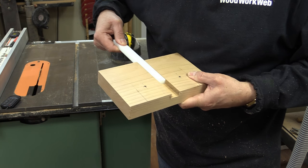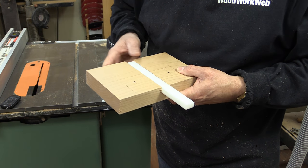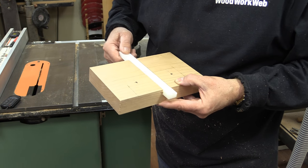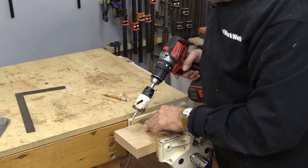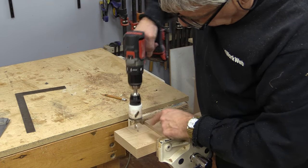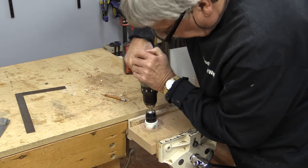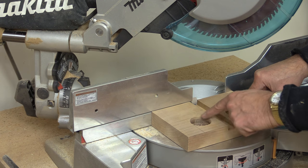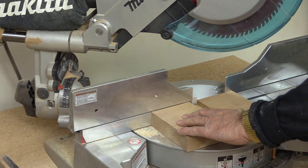Back at the table saw — this is a plastic material and it's a little snug, but I think it's going to be fine. I may need to do a little bit of sanding on it, but for the most part that's perfect. Next we need to drill out the holes. I could use the drill press but the hand drill will work just as well. I've already put a starting hole in there. Before I go over to the band saw to cut out the U-shaped part, I'm just going to take some of the excess material off.